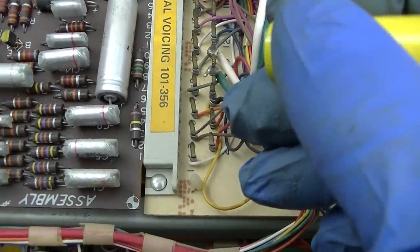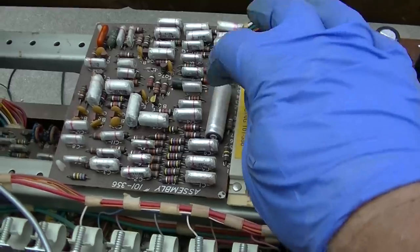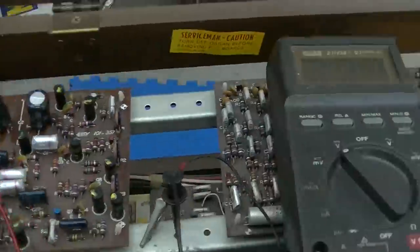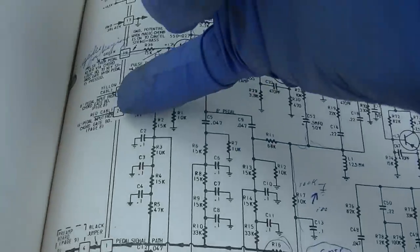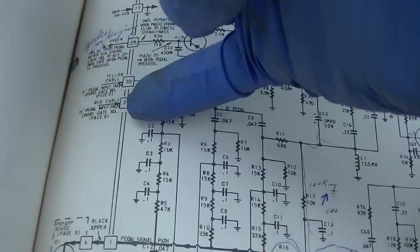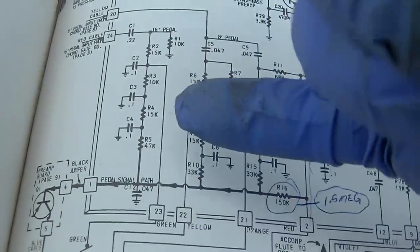And then it should be coming out on one, and there's nothing coming out of this board, and I'm looking at you right here, big boy. And it has 14 volts across it. It's exactly what it should have. So how could that almost not work? It's all passive. Let's see, it comes in on 24, it goes down and out one. How could that almost not work?